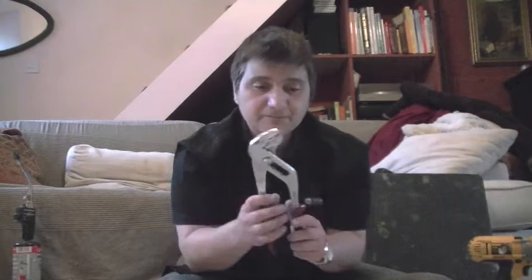I've also got a larger one. These are very good for doing the nut underneath if you're fitting a toilet siphon, and also very good for central heating pumps — so called pump pliers. For when you want to work with two hands and still have something gripping, I also have mole grips. Again, adjustable and they stay closed.